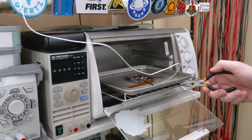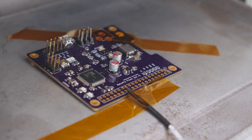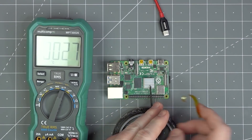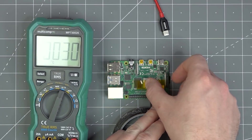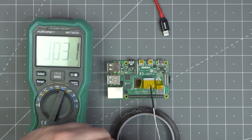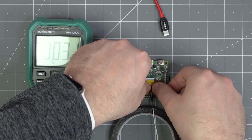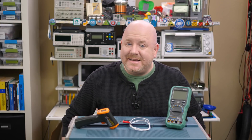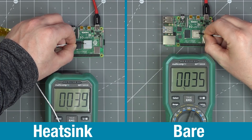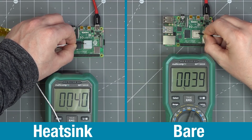When I use my super-advanced reflow oven, I try to stick the thermocouple into a hole on the PCB. Another option is to use high-temperature polyimide, or Kapton, tape to attach to something like this heatsink. My experience has been that while the film can handle 400 degrees Celsius, its adhesive usually cannot — at least not for very long. Notice how the thermocouple shows a new temperature that is about the same. This measurement suggests to me that the heatsink is drawing the heat away from the silicon, but not doing much more.